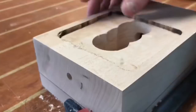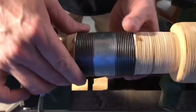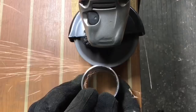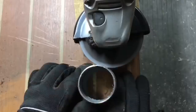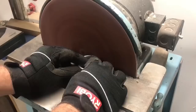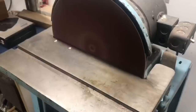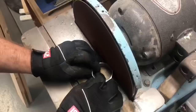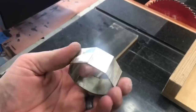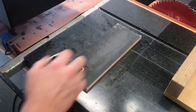Back at the lathe, I use a two-inch plumbing pipe and need the smooth section between the threads. I clamp my angle grinder to the workbench to cut the ring — this is my method, not necessarily recommended. After cutting, I bring it to the disc sander and grind down a flat surface on eight sides to create an octagonal pattern for aesthetics. I then use 400 grit emery paper on a sanding block to hand-rub each face for a cleaner finish. This metal piece will be the base collar that the cicadas rest on as the light shines through.